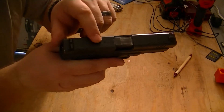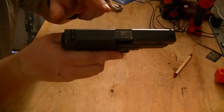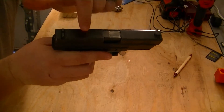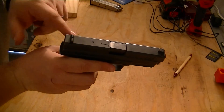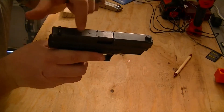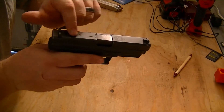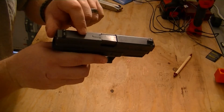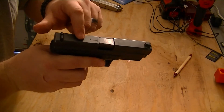There's also this little hole here — I don't know if you guys can see that. That is actually where a pin goes; there's the firing pin. This holds it and keeps it from going too far forward. What happens is if you dry fire that too often, that pin can break and then you have to replace it.